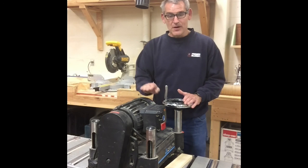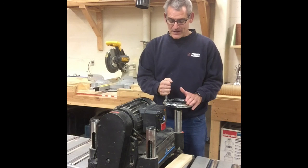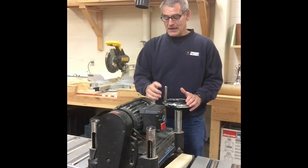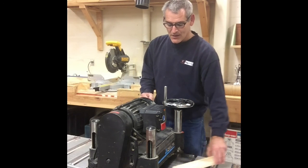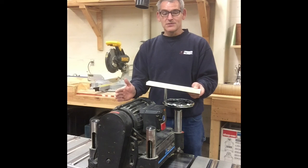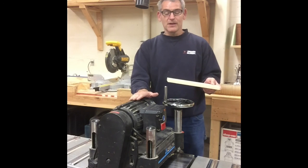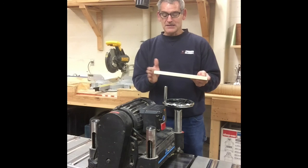The cutter heads are on top, so we lower this down a little bit each time. About an eighth of a turn of this handle gives you about a 32nd of an inch of depth. There's an infeed roller and an outfeed roller, and after you get a board started it'll take it from you. Your board has to be at least as long as the distance between those two rollers — on this particular planer, that's about a foot.